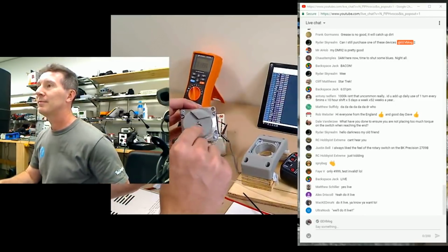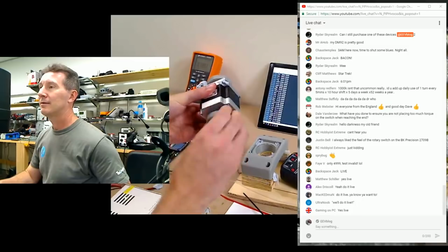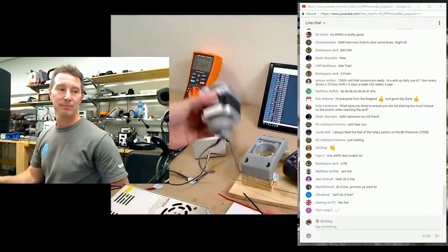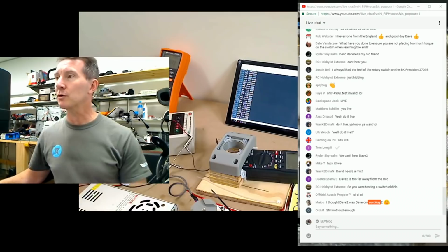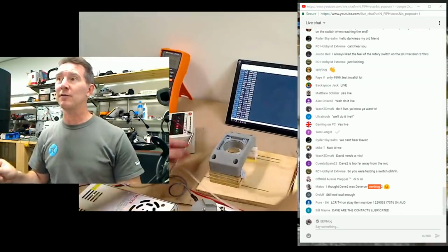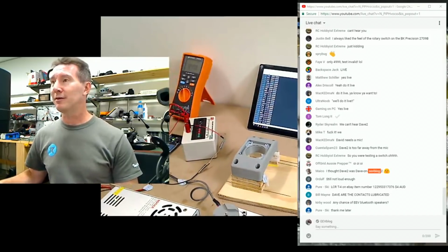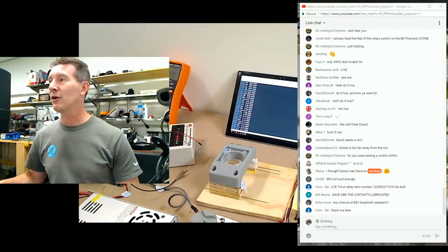There's a permanent marker on the shaft and a permanent marker on the plastic. It's pretty secure. This side is set to be secure. This side's set to slip like a torque wrench, so I can't put too much force manually into the dial. To calibrate it, I just go whoop, and it moves all the way to one side. For those that didn't hear that, those wires are hooked up to the off switch position, which is actually the reset line of the micro. The switch holds the micro in reset. When you hook instruments up to it, or pull-ups and parallel resistors and everything else, it screws with the pull-up on the reset line and it doesn't switch on.